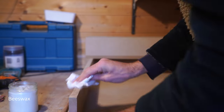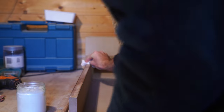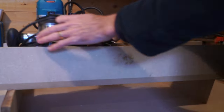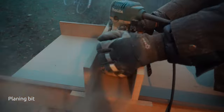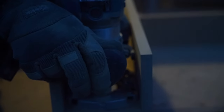This next step isn't a necessity, but I took some wax and basically put that on the top of the rails, and that just allowed it to slide a bit easier. Now we're going to put the planing bit into use in a different way — we basically just use the plunge router and slowly take passes out of the top of your sled, making the hole where your planing bit will eventually come through to do the planing.